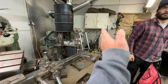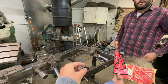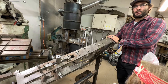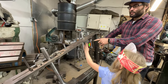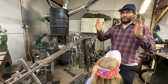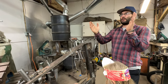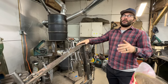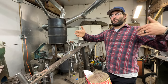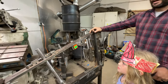How do you get a desired head tube angle and a desired seat tube angle and still hit your top tube length? I actually did it with one guy — he wanted a wild seat tube angle and head tube spot but wanted his hands to be in the same place as they are now. I put it in the computer and figured out that going from 71 to 72 seat tube angle, we needed to go about 3/16 of an inch shorter on the top tube so it would feel the same. That was kind of fun to do the math.